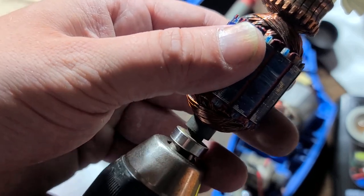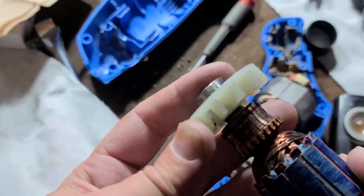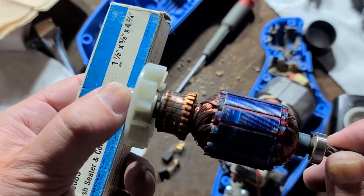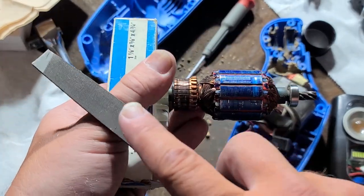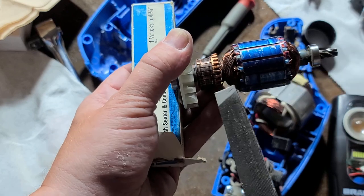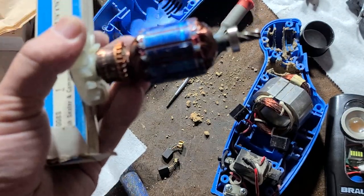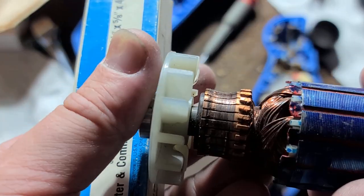You have to be careful not to damage the gear teeth. Chuck it up just lightly enough to spin it while using the file. On motors with a bearing, you can place the bearing on the edge of a surface so it spins freely, then go across with the file. It's soft copper so you'll need a wire brush to periodically clean the file. You don't need to spin it fast. Other options include a piece of sandpaper folded over a flat piece of wood to flatten the commutator.